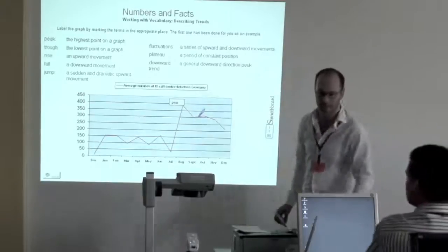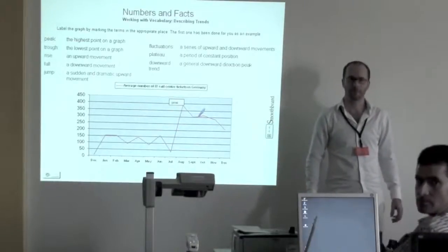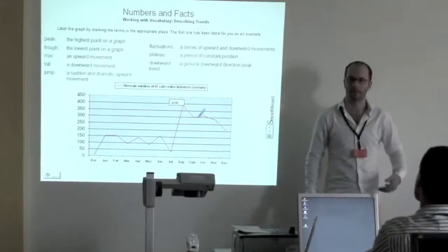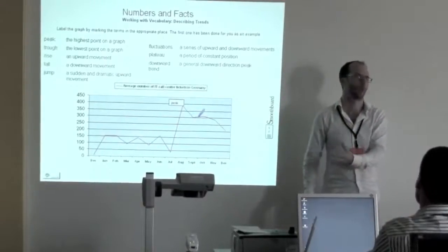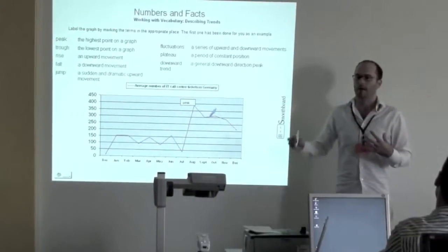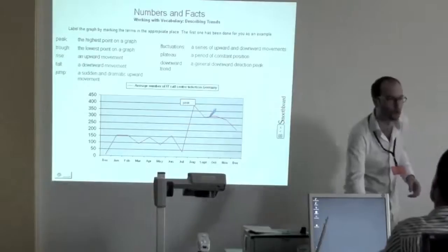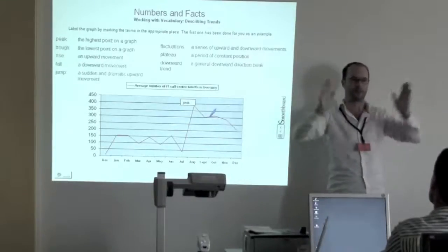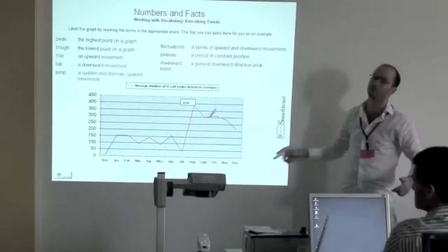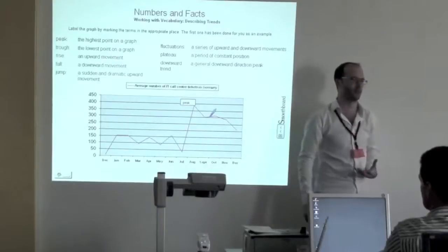Maybe some of us have got fears about the reliability of this. It's DIY, so maybe there's a question mark in our minds. How reliable have you found it? I found once you get practice with it, it's 100% reliable once you get it up and running. The difficulty I found was working out the angle that the camera is at. The camera itself has a field of view of around 40 degrees in this way, and around 30 degrees in that way. So you need to place the camera somewhere where it will be able to see all of the screen. In the beginning, you might not always get it right, but it's a question of practice.